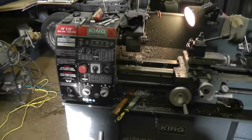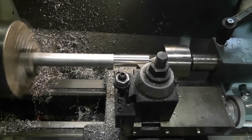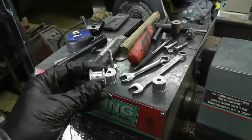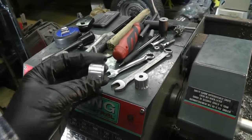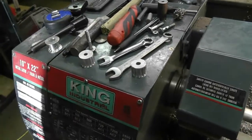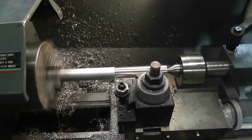I'm going to get on this and see if I can crank out some blanks for my pulleys. I'm just taking a skim coat here on the outside of this and then I'm going to start machining it down. There's no reason for me to be advancing it so slow — I just like the shiny look. I'm not going to turn a flange on these ones. I'm just going to count on the actual machine lines to hold the belt in place, and if it's well aligned the belt shouldn't pull out because the belt is constrained by the stage — the X or the Y stage.